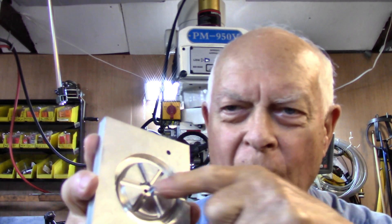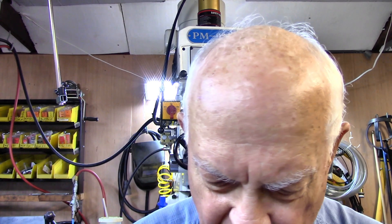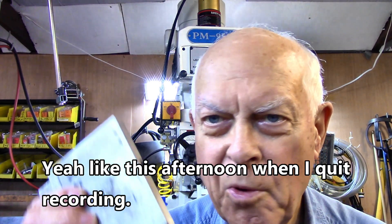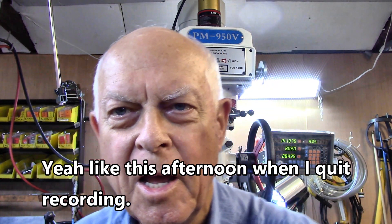This is where Mr. Pete would drill a hole and thread in a set screw — grub screw to our friends across the sea. I'm going to put a little boss here, a little piece of metal, so there's more to drill into and more for the threads to hold onto. Once we get through with that, we'll worry about the ZAMAC, which hasn't arrived yet — I ordered it last week and it'll come sometime this week.